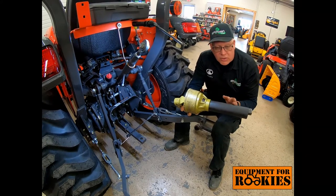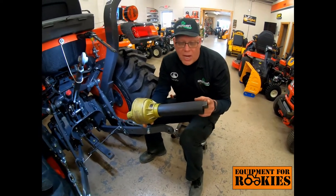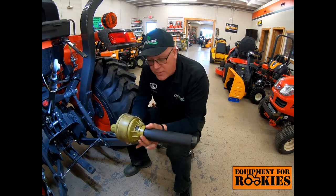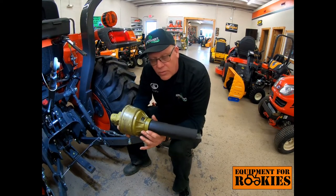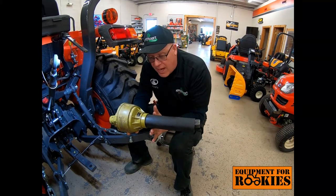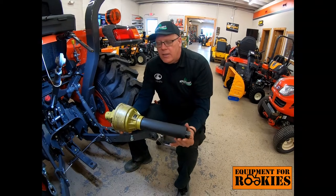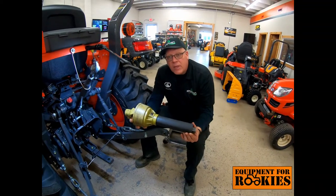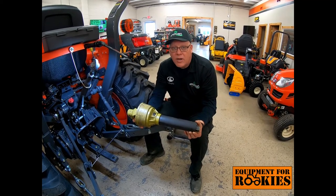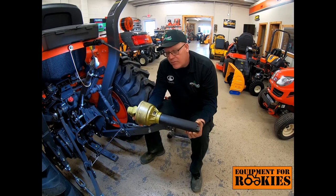You're looking at the shield, but the shield, if cut properly, will be cut with the shaft sticking out approximately an inch past the shield. You can telescope this down and get a visual representation of where that shaft is collapsing to. This is very important because the damage can be significant to either the attachment or the tractor — normally it is the tractor. Double check that when installing an attachment for the first time.